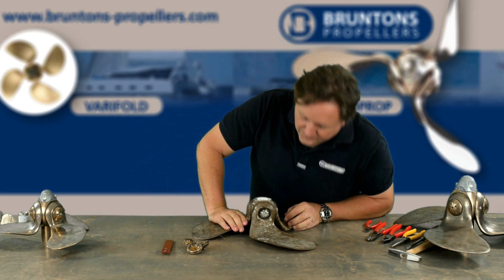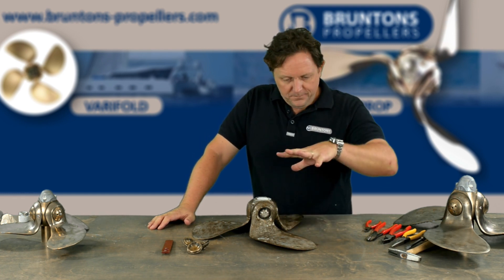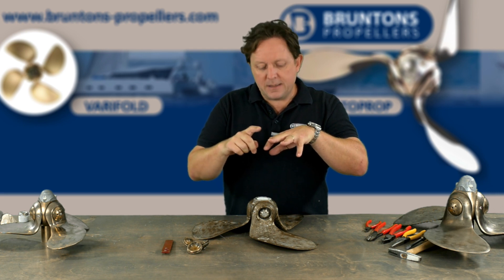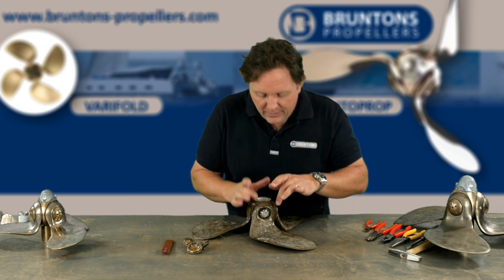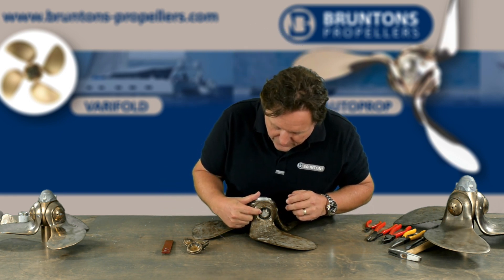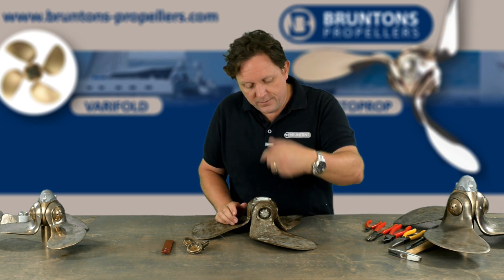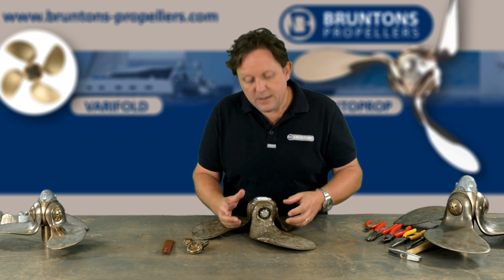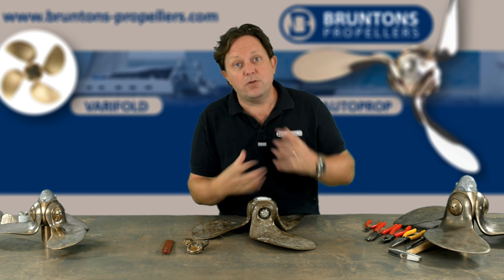Inside you'll see a tab screw — it looks like a daisy or flower with fronds — and the lock nut has four grooves: north, south, east, and west. When you put it back together, you pick one of those fronds and push it into one of the grooves to lock it in place, securing the lock nut. The trick now is — either with a screwdriver or pliers — to find the little frond and lift it out of the nut. This is a left-hand thread so it winds off clockwise, and underneath is a conventional right-hand thread nut holding everything together. The two work against each other so when one loosens the other tightens, holding it all together.